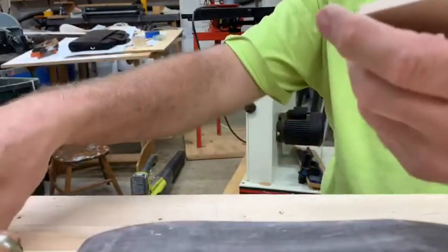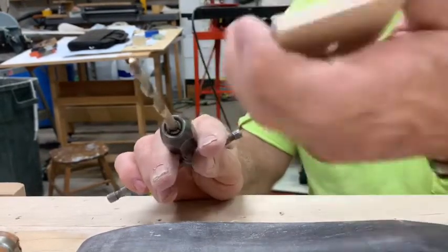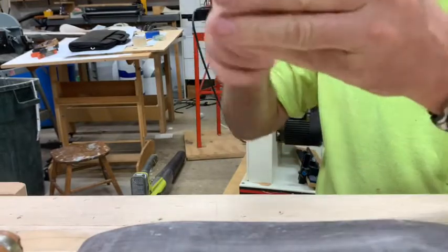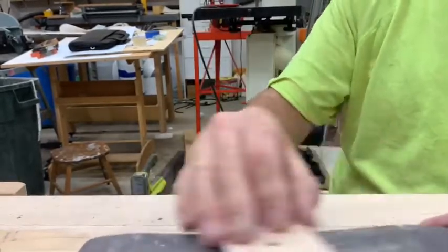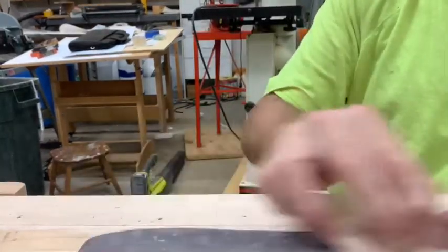And I don't think that a brad point bit, which has a point on it, and instead of it being like this, which this was having, obviously had a tendency to tear at the maple, I don't think it would have eliminated this step. Probably lessened it, but you know what? It's a Friday afternoon, and I'm having a good time sanding these blocks.